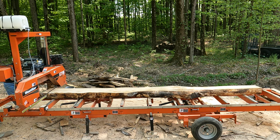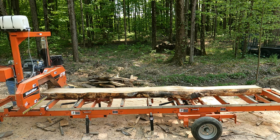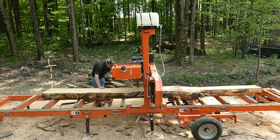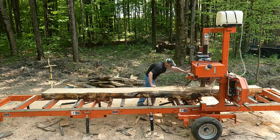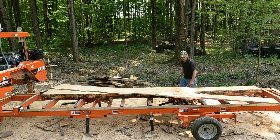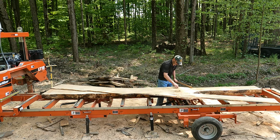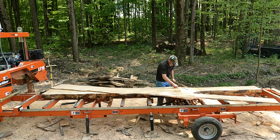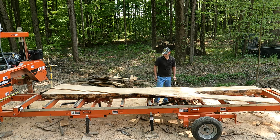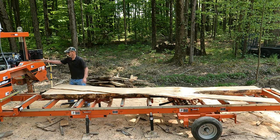So right now I am at six and a quarter inches thick. So I'm taking it down to 5 1/4. This is what I wanted to see right here. I need to know if the beam is going to be solid. I don't know, maybe. I can't go down any further there. That was 5 1/4, so if I take it down to 4 1/8, I got my 4 inches. What the heck? It's just wood, right?